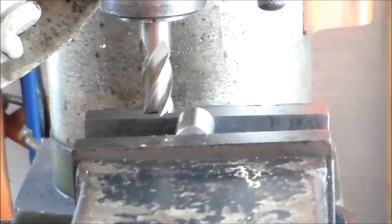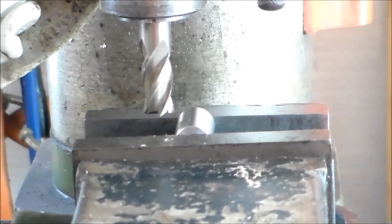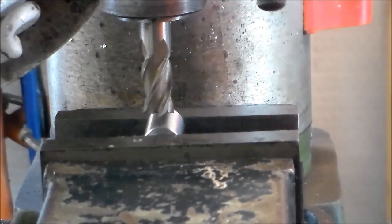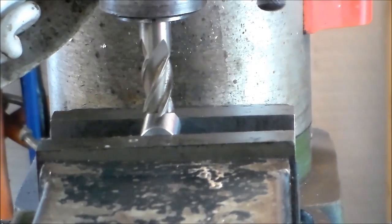The stock I used for my coupler was sold as five-eighths, but if you measure it, it's actually 16 millimeters — so it's not exactly what they said it was. So if I move over half of that stock with a half-inch end mill in there, I've come up with needing to move over 0.565 to be on the center line. That should be 0.565 — if it looks centered, it looks pretty dang good. I'm going to lock the table down and switch over to a drill bit. You've got to use a center drill on this.